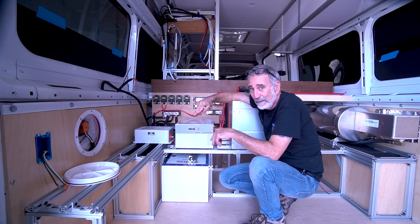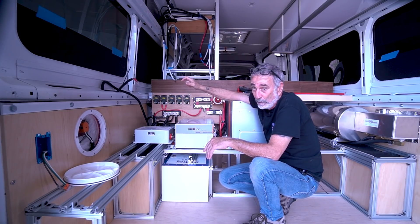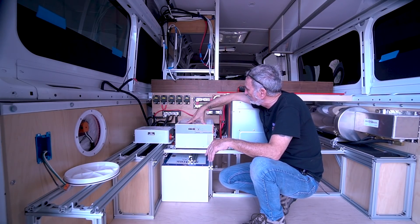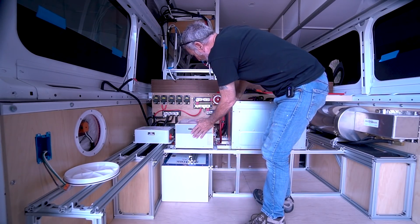So what do you think — which way should I go? Should I do series-parallel into one controller with high voltage, upwards of 60 to 65 volts? Or do I bring each leg down in 12-volt parallel to separate controllers? That's the way I'm inclined to go.